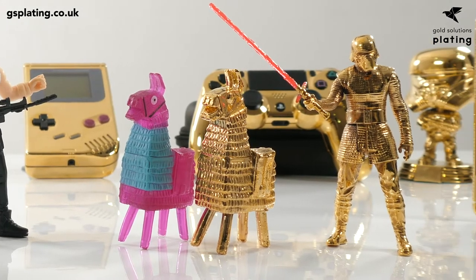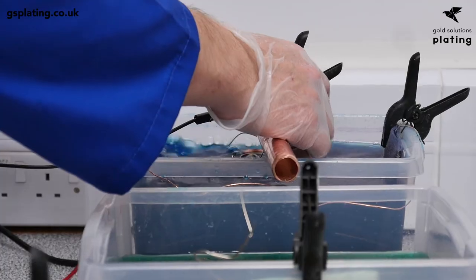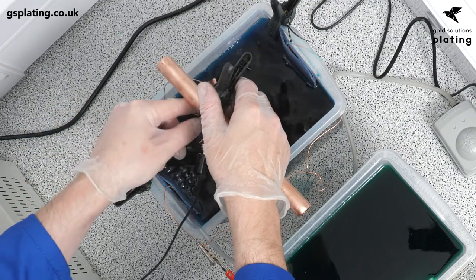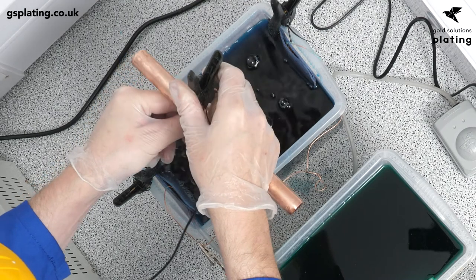For more information on the Mirrotec system please see our website. You should leave the item in the tank for a minimum of 3 hours, although 6 hours or more is common. Revisit the tank every 30 minutes to move the item slightly within the wire that is clamping it — this will help to break any minuscule bonds that may form and will prevent your wire from fusing to the item. You can also use this time to move any articulated joints to allow even coverage and to prevent the joints from fusing in place.